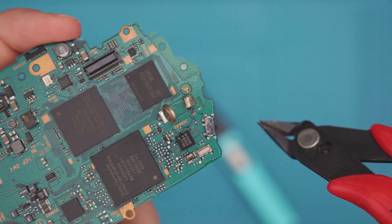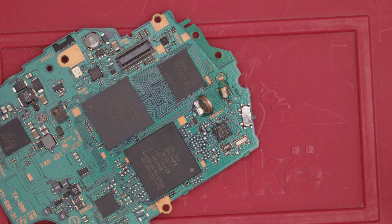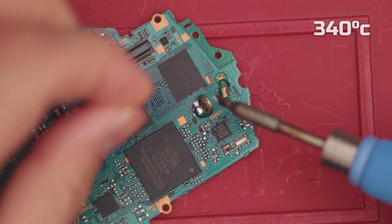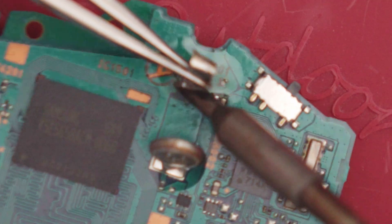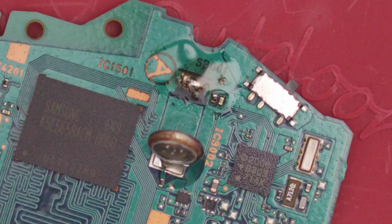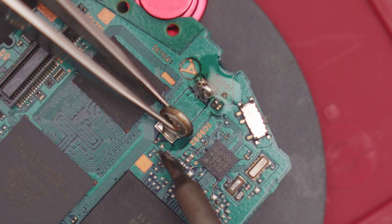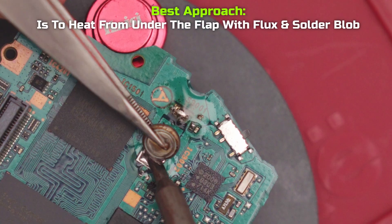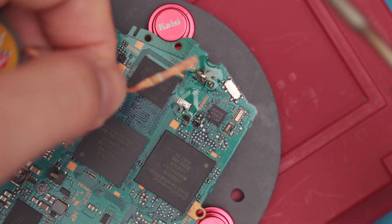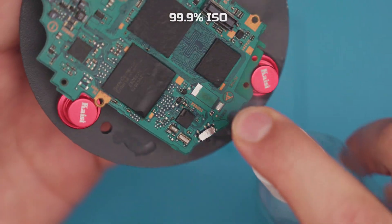If you're wondering how to solder, I've got some plans for that, so stay tuned. Let's go ahead and add some flux — just a tiny bit — to make things a whole lot easier. Get our iron nice and hot, apply some solder, grab our tweezers, and basically go at it. Hopefully that stops it from moving around. For this one, you could try heating it from both sides — the front as well as the back — to kind of help it out. Then go ahead and grab our wick, clean things up.